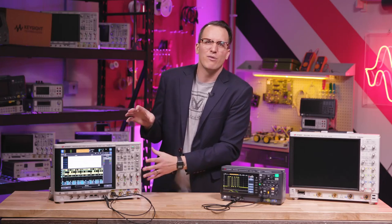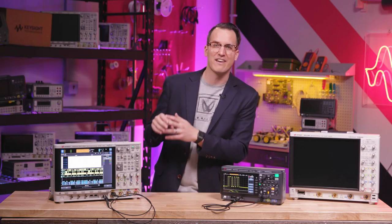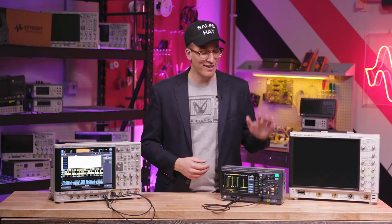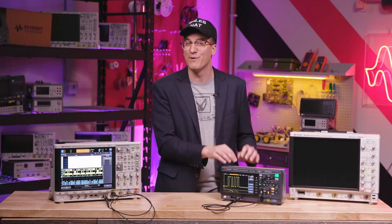There are some okay USB-based scopes out there, but there's no substitute for a modern digital oscilloscope, and they really aren't that spendy unless you want to get fancy. They can decode serial buses and help you figure out that you connected your TX to your TX and your RX to your RX — been there — and help you spot any weirdness causing unreliability or intermittent failures. This one also has a digital voltmeter, frequency counter, and a 20 MHz function generator with ARB built right in. Plus eight points if you have a benchtop scope, and two points if you only have a non-benchtop scope.